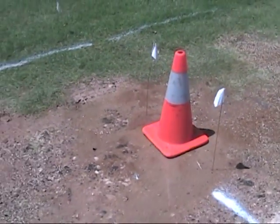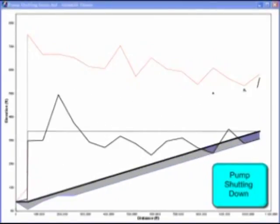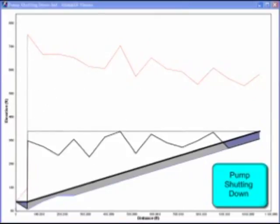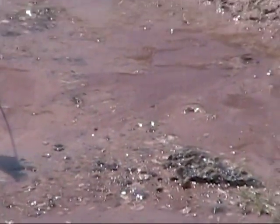Every little leak in an underground pipeline is also a place for contamination to enter the water system. The high pressure spikes cause leaks in the piping, and the negative pressure waves actually draw dirty water in through the same leaky spots. The muddy water outside the pipes, caused by the leaks, actually gets sucked back into the pipe during instances of negative pressure.